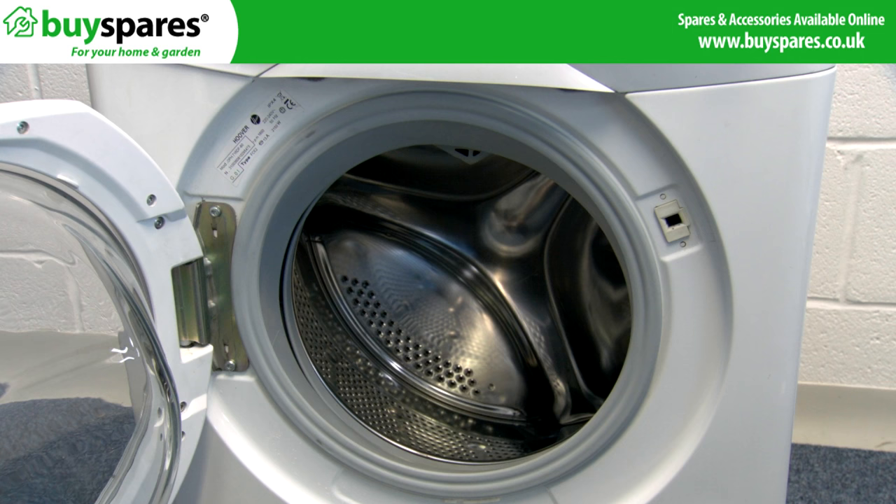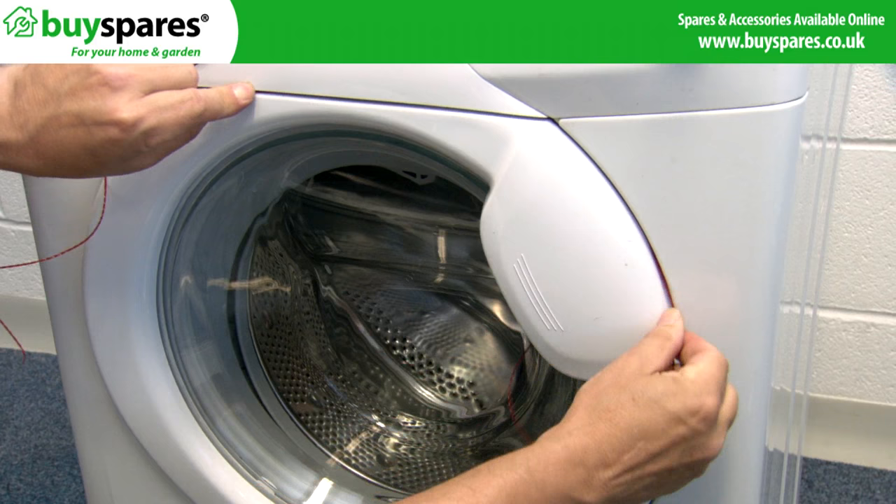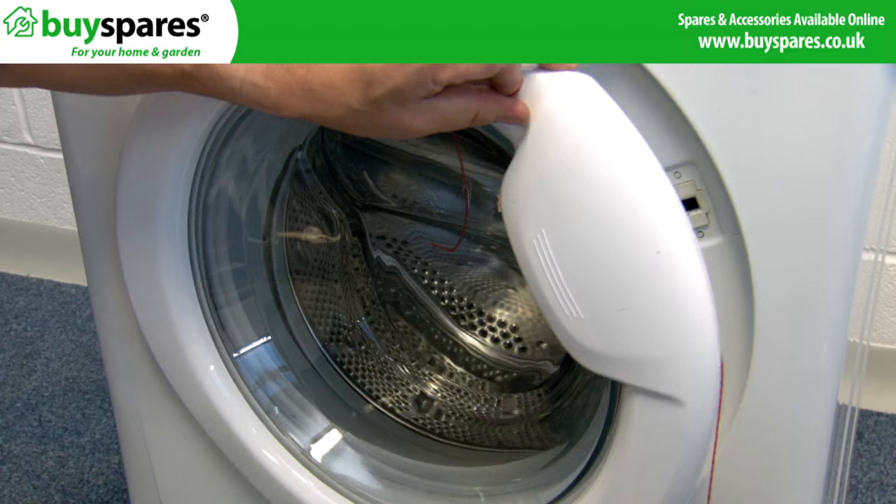If the door handle is loose and does not move the catch, it may be possible to use nylon trimming line or even an old credit card. Take a length of grass trimmer line or strong nylon cord and pass it around the door frame. By pulling the line to the other side of the door it should move the hook, releasing the door.